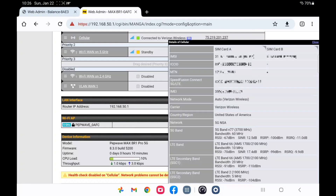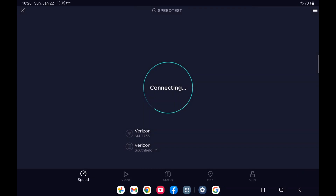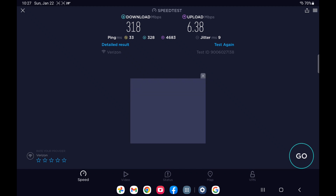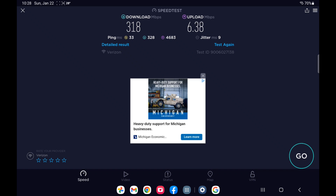Let's go back on to N77. Now we're on N77 with the same LTE bands. Running the speed test — the download was very flat at 300 to 320 megabits per second down. From what I've seen, that is a throttle on their C-band, at least for the home internet SIM card I have. The upload seems to be more like a 20 to 30 megabit per second limit. So I would not be surprised if adding an antenna on Verizon C-band doesn't improve download, because I think I'm throttled by the carrier.